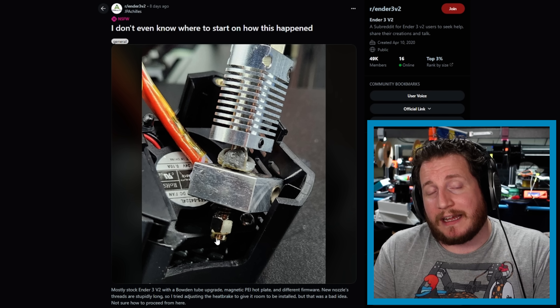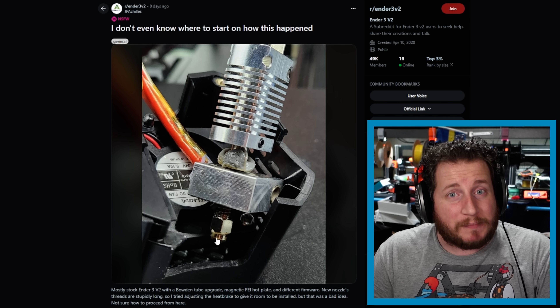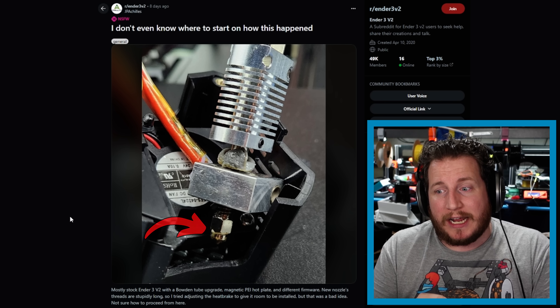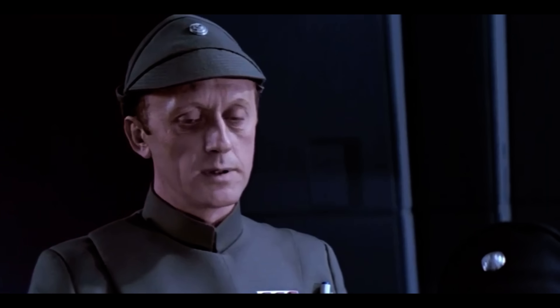Unfortunately, you will have to disassemble this system when it is warm just to clean off all that excess plastic that has made its way up through the threads. If the nozzle is not tight against the heatbreak, go ahead and make that change. If this is still the stock hotend for the Ender 3 V2, we highly recommend upgrading to an all-metal variant — that will certainly alleviate quite a few of the issues with this printer.